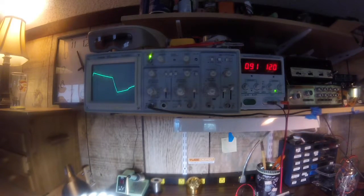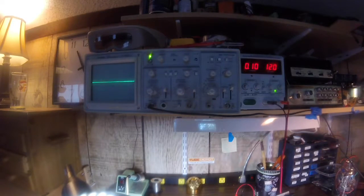You can see that the signal is horribly distorted. I'm going to turn down the volume until the signal is just below distortion — that's about minus 10 dB on the signal generator — and you can see we've got about half the current draw. So the line level is providing a heavily distorted signal out of the amplifier. Let's see what this sounds like at a higher frequency to better hear the distortion coming out of the speakers.